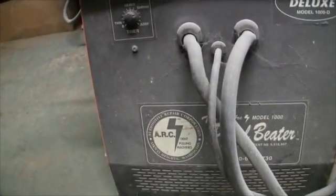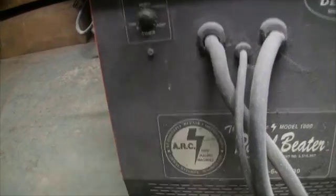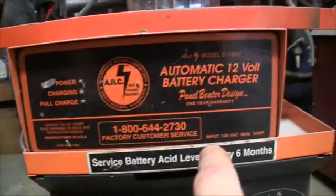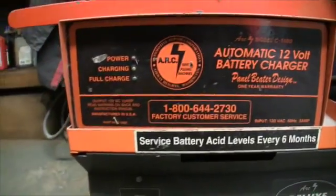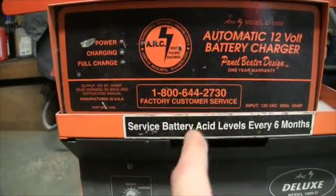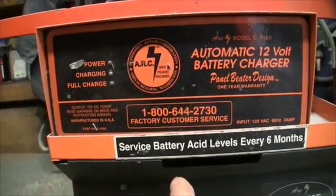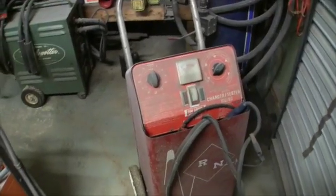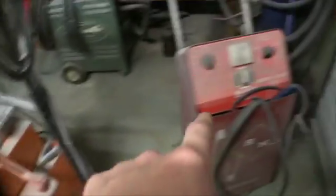The contactor is probably three inches by six inches tall, and you can hear it when I engage the machine. That is what gives you your current. It also comes with a 12-volt battery charger — you can leave it plugged in all the time. However, if you've got a bad battery in the unit it will not run it. Even a roll-around charger with a 500-amp jump-start feature won't overcome a bad battery — it needs the power of the battery in addition to the charger.